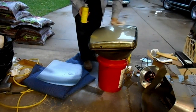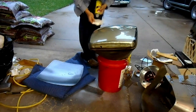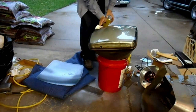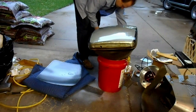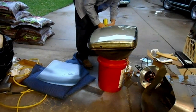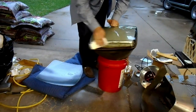In another instance where I was experimenting with the sun method, I was trying to use mirrors to gather more sunlight to heat the tube more, and the mirrors unevenly shined on the face of the tube, creating a hot spot that caused the face of the tube and the bell of the tube to fracture. Both of those incidents could have ended in implosion, which is why any method that changes the temperature of a tube significantly has to be done very carefully.